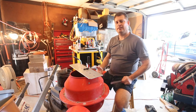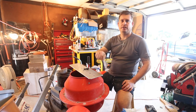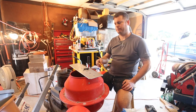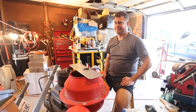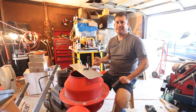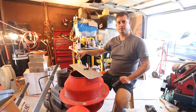I needed to make this plate to mount my retrofit lights, and it's quarter-inch aluminum ordered from metaldepot.com for about $40. I shaped it with a jigsaw and drilled holes by hand — it's really making me miss my CNC mill, it's just a lot of work by hand. So I needed to mount the lights and decided to drill and tap holes.